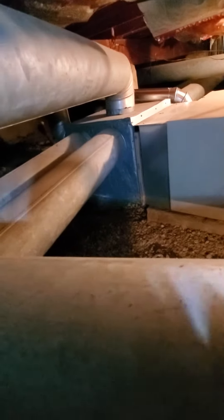Your filter is right there — it's 16x20 by one. I don't know if we need to change that to 16x25 by one and kind of make that happen. But this is your hatch here. The hatch measures 26 by 18 inches, so I think that's good.